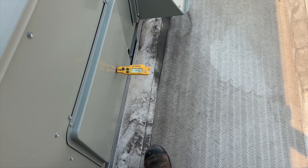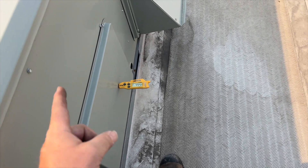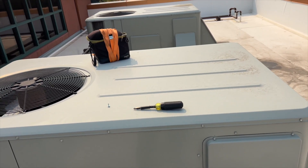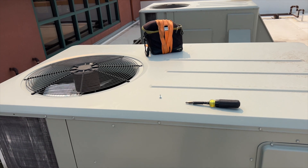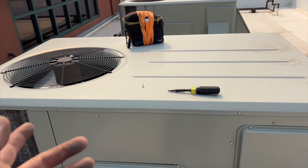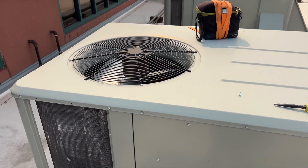She's definitely cooling. Our return temperature is like 68 degrees, and this is our discharge temperature - not our supply - so it's going to be a little bit colder because it's coming right out of the coil. Looks like we had some issue with the economizer. I was checking those splices and one of them wasn't that great, so I tightened it up - I think that might've been the issue. Now she runs with the economizer hooked up. Looks like it was just a loose connection. On these Trane units, that's very handy to know - if you ever need to bypass the economizer, you can just unplug it from the board. Somebody in the comments actually educated me on that.